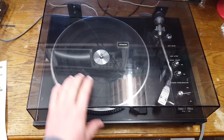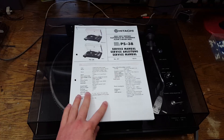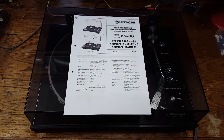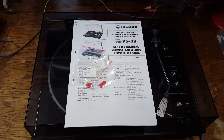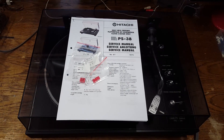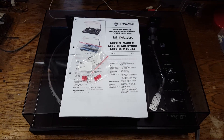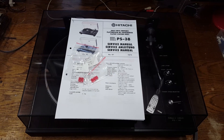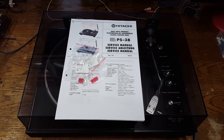I have already printed out the service manual, which lists the values for the capacitors that we need, and I have ordered those capacitors. The important part is to use X2 rated capacitors — those are designed to be connected across the mains permanently. If you put in capacitors without the X2 rating, that can be unsafe.